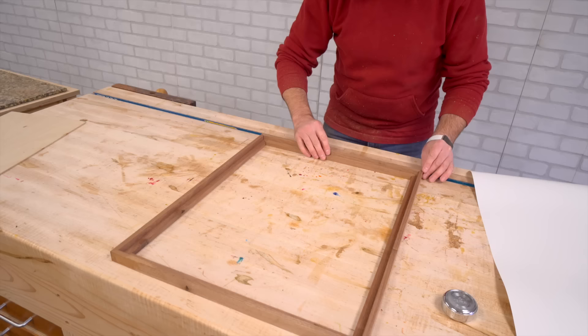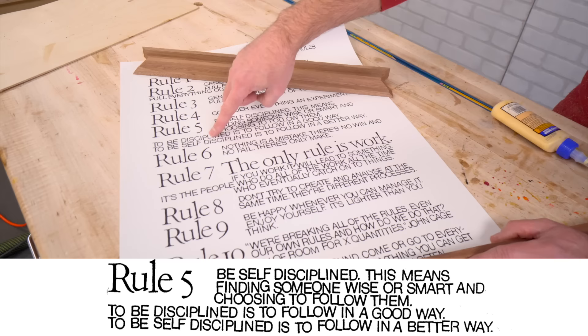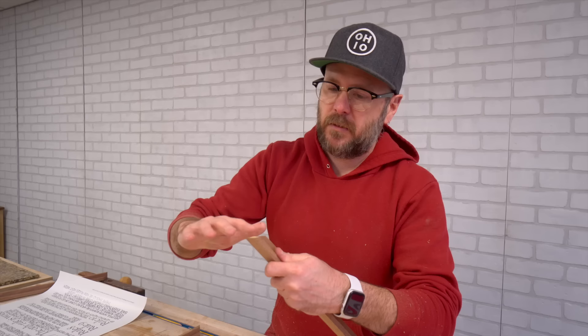It's going to fit in there perfect. Rule five: be self-disciplined — this means finding someone wise or smart and choosing to follow them. To be disciplined is to follow in a good way; to be self-disciplined is to follow in a better way. So before gluing these together, I'm going to rub a little bit of glue into that end grain and let it sit and dry. That'll seal it off so when it's time to glue up, all that glue won't get soaked into the end grain.